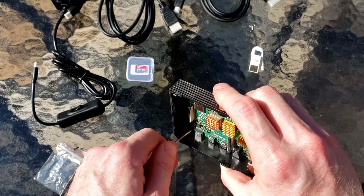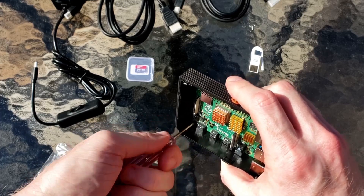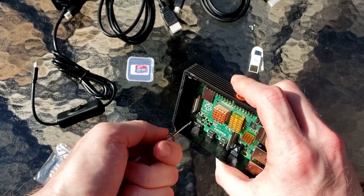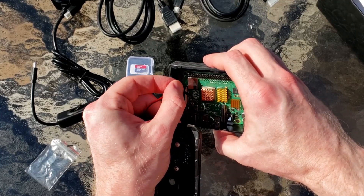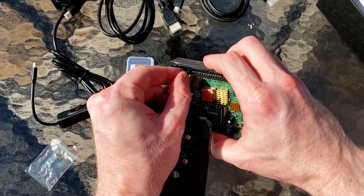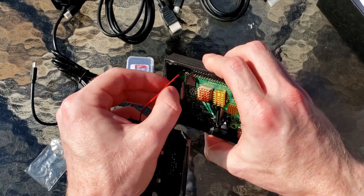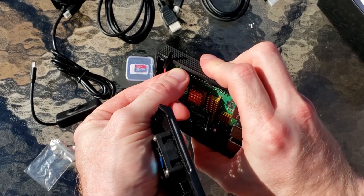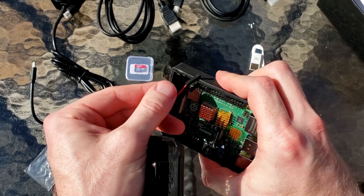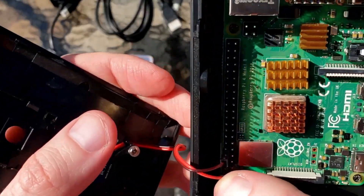Installation is fairly straightforward and easy. The instruction manual will tell you where to place the heatsinks, and there are four screws that hold in the Raspberry Pi. The fan screws right onto the top of the case, and then you plug it onto the GPIO pins and you're good to go. The hardest part about this entire install was plugging the fan onto the GPIO pins — for some reason, the connectors did not grip those GPIO pins very well at all and they kept popping off. After a bit of effort, I did get them on.